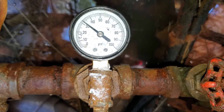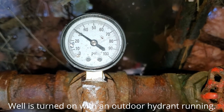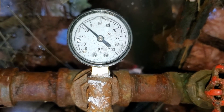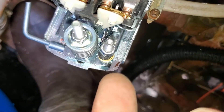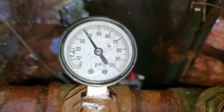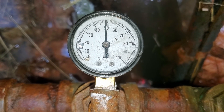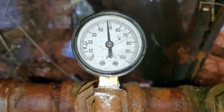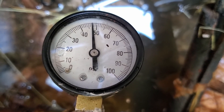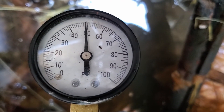So hopefully we'll cut in at really close to 30 — or a tiny bit above, even. There we go, perfect. And then since we increased this screw by two turns, our cut-out should be a little bit higher. And there we go — that's pretty much perfect. So as you can see, we adjusted those two screws and made it so that it was cutting in at 30 and out at 50.